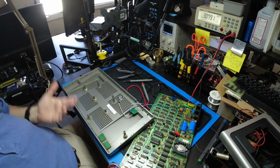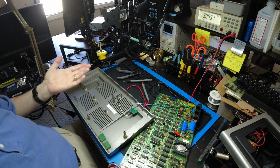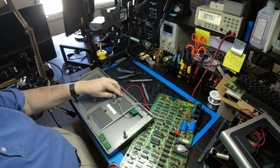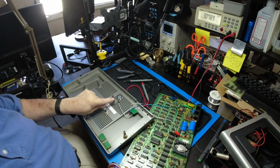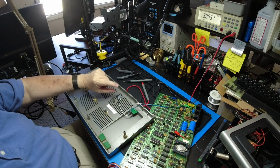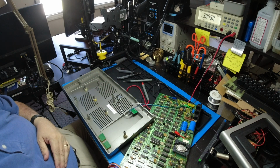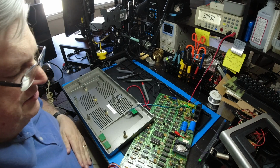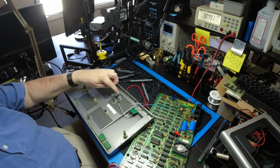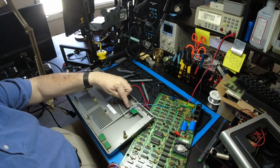If you want 2 speakers, if you think you need 2 speakers, or you get a bigger speaker, as long as it's 8 ohms, a couple of watts, whatever. Just remember the clearance. You've got a little clearance to play here because the board is going to sit up here on this neck. So you've got all that space minus whatever other components are sticking down. Right about in this area, I would say maybe the power transistor, or the big capacitors are sitting right in here. Power switch is right over in here.